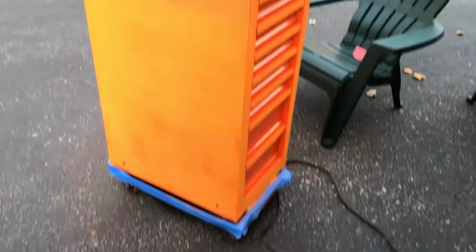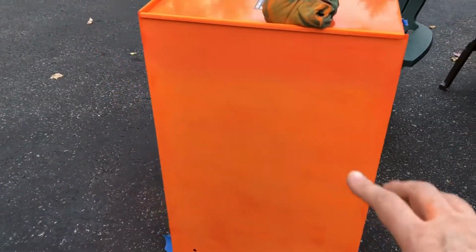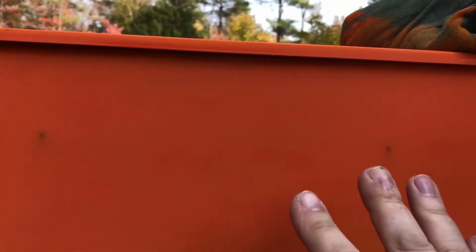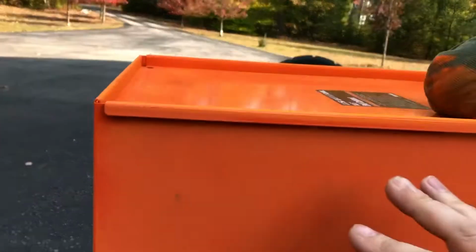Work the trick. I mean, seriously, I have 15, 20 minutes. This side sanded. Again, this is just a nice flat surface. So this side sanded, and then you wipe it down with a rag, and you're going to eventually use solvent, and you're looking for shiny spots to get, again, with the sander or by hand. And honestly, look at that. I don't know if you can tell, there's no shiny spots. I mean, this made quick work of this powder coat.